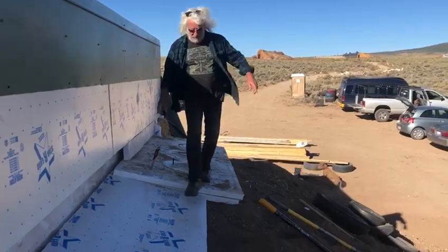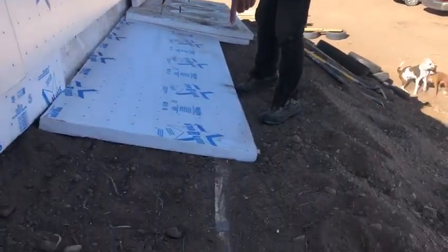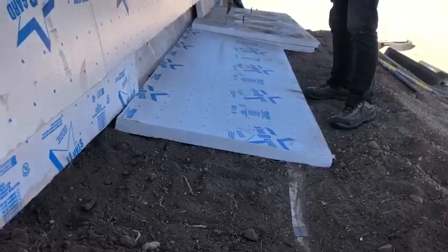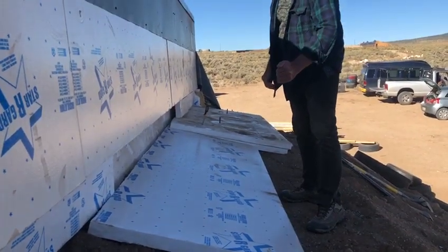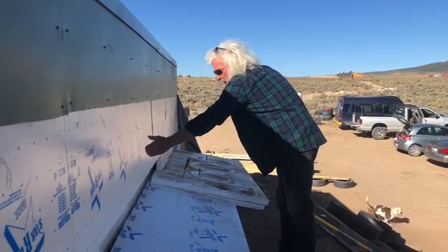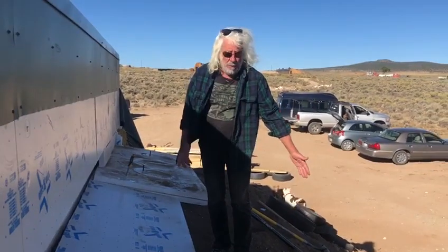It's coming along here. Here's the top of the thermal wrap coming up from vertical below, and now we're laying two pieces out over that, connecting to this. So we've got an unbroken envelope of insulation around this building. Then we'll be putting EPDM up under here and down, skirting it out for a vapor barrier and waterproofing.